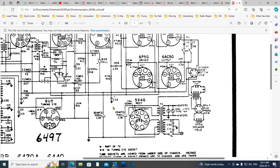So those are probably the two canned guys. Often these cans are multiple units. We'll flip back in a minute and check on these capacitors. Now, another thing, I can pull this tube out, and that'll stop anything from happening out here. All we'd be doing is energizing these capacitors and the heaters. We'd be supplying the heater voltage here, but it's not going to do anything. And we'd be supplying the plate voltage, and it wouldn't be doing anything at all. So we could do that.